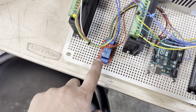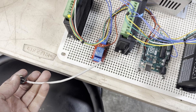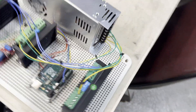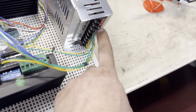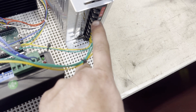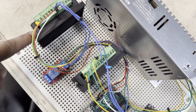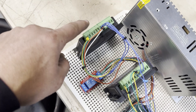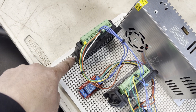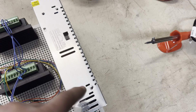It will wire into our terminals here and here, or whichever two. The shielded wire needs to go to a ground. What I'm going to do is when I run my 110 volt, the earth ground here — I'm going to do a little splice to each one of these housings. Because they're metal, I'm going to ground those through one of the mounting bolts, and then I'll just run this shielding wire to share that ground, because I have to shield the motor wires anyway so they'll all share ground. Or maybe even from up here, if the housing's grounded, I can use these terminals there.